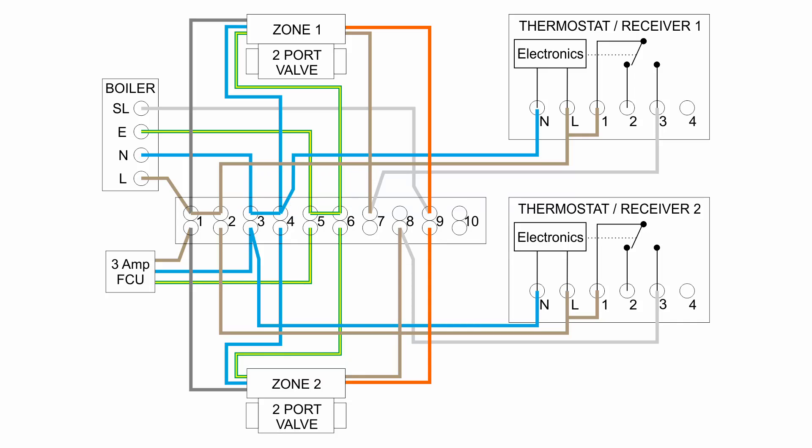There are two ways you can do this and we're going to cover both of those in this episode. So let's just have a look at what we got to last time and see how we can amend that for use with a lower voltage boiler. We'll start here with the diagram we ended up with last time, which is for the 230V switching. Most of the wiring is actually going to be the same, and if you haven't seen the previous video that's already been covered, so links to that in the usual place.